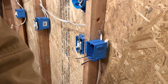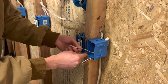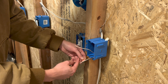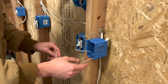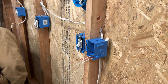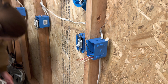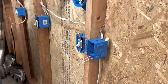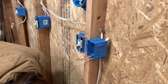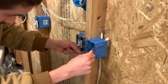As far as the switch box goes, you're going to need a few pigtails — grab yourself a ground pigtail and a power pigtail: a solid ground wire and a black wire. Your neutral is going to tie together, and your red wire will be basically your switch leg. I'm going to grab a wire for my pigtail and get some wire nuts ready. First things first, start with your grounds.